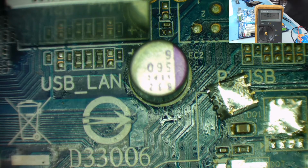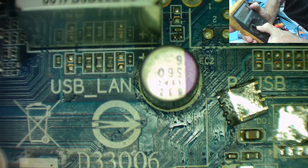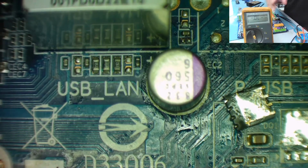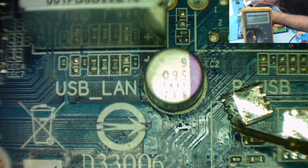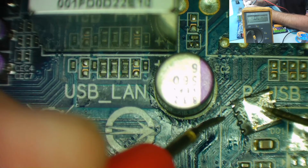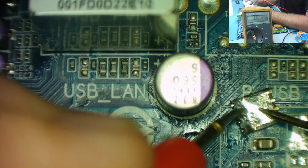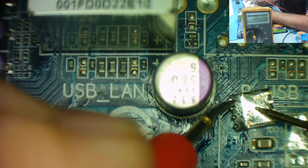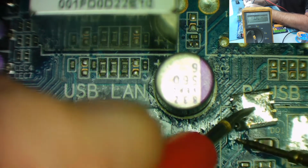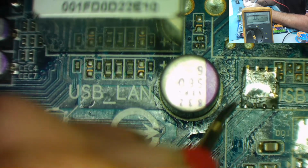Way to test this. Go to diode range. Okay. Now, this will be the source or the drain, and one of these 4 pins will be the gate, and the other 3 will be the drain or the source. So that's reading, right, that's the gate because it's reading nothing. Now this is a good one. I'll show you why. Let me just turn it back over again. Let's make sure you can see.